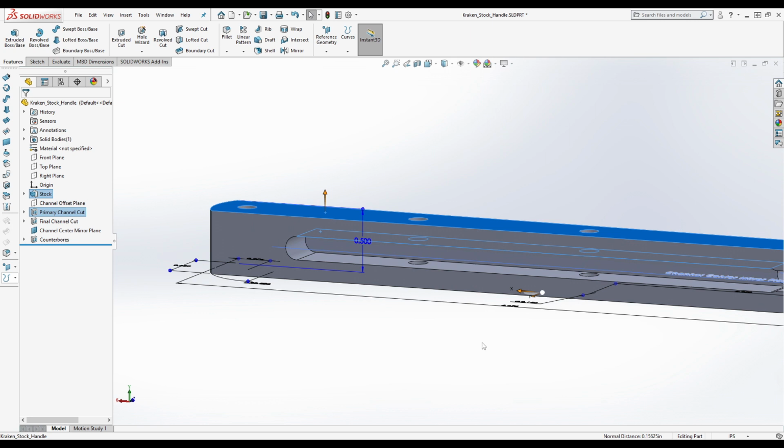Let's say you get a perfect scan of this exact handle that I have right here. If you can machine this so that it's exactly like this one, it will work. But let's say his was off by 5/1000ths and you're also off by 5/1000ths in the same direction. Now, suddenly, it might not work. So it pays to try to figure out what his initial model was so that you get rid of whatever potential machining problems or imperfections he would have, right? So yeah, that makes sense. Cool. So that's the reasoning behind that.